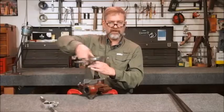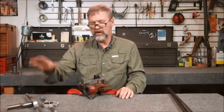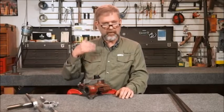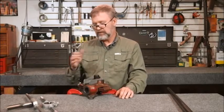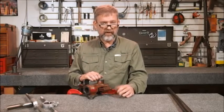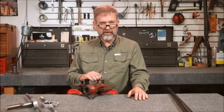If you were doing a Remington or a Savage, those threads run out at the bottom of the receiver so they'll stop pretty readily — it won't take much to tell when you're at the end of the thread. Now these are the kind of tools that are reasonably expensive — not terribly cost prohibitive — but if it's something you're going to use in your shop all the time, by all means go get them for the specific guns you work on the most. If it's a tool you might use rarely, or maybe you're a hobbyist who's only going to use it once, there's a very cost-effective way to get these tools: you can rent them from us at 4D Reamer Rentals. And that's your Workbench tip for the month.